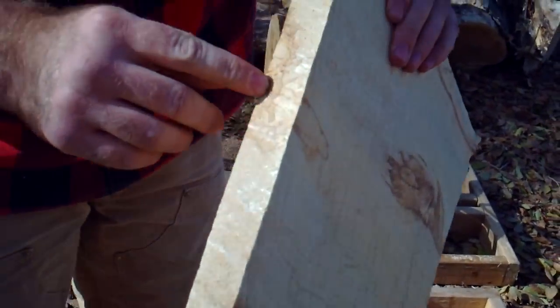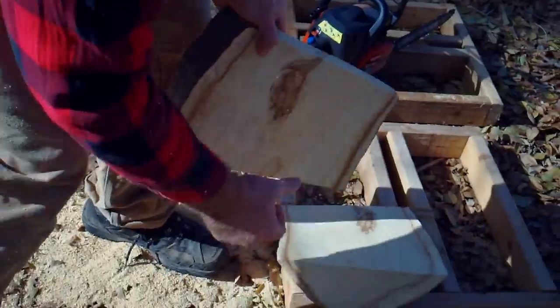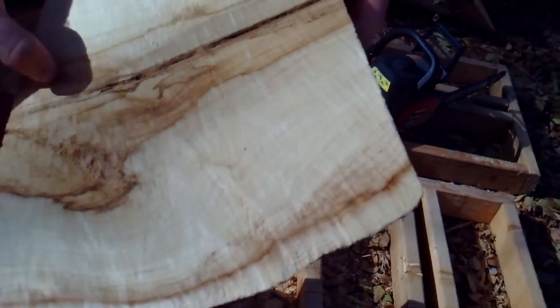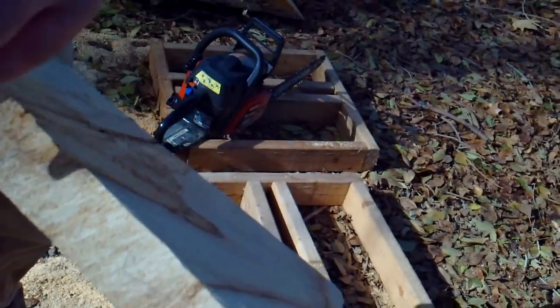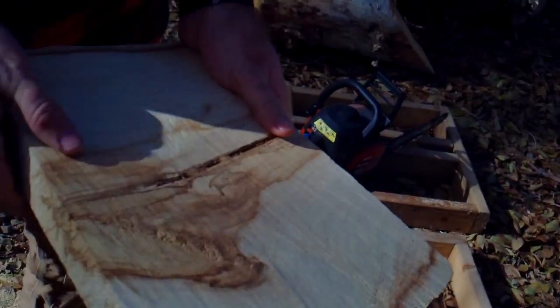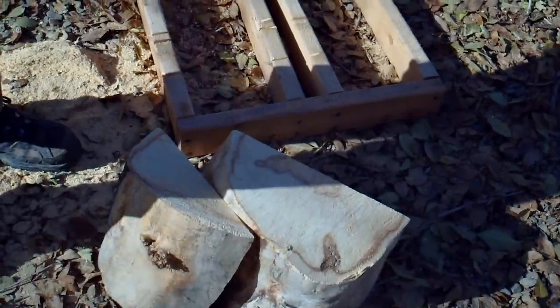I've cut the pith out. You can see it starts on this side right there and ends on the other side — the pith came out on the diagonal. I've got it out of both blanks, so now these blanks are going to be very stable. I can get my circles marked out and get my bowl blanks roughed out on these and then wax them. I've got my quarter-sawn material and can get some good handle blanks out of these pieces. This piece has a knot from a branch, so it might not be as usable, but if we can get some of that color it brought in and stabilize it with thin super glue, we might be able to use it.